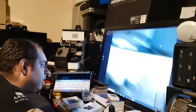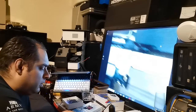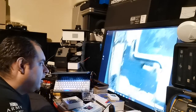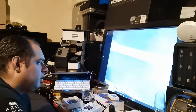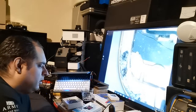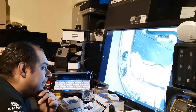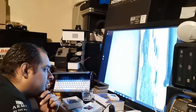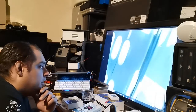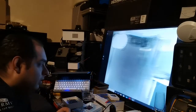Okay. Alright, that is interesting though. Let's have a look at the rest of our charging port then as well. All of that does seem to be fairly okay. The Taptic engine is there as well. Alright. So this is going to be much more of a pain in the arse than I was thinking or hoping initially. Right. So it's possible logic board damage. And definitely looking like components are missing then. That makes a lot of sense.